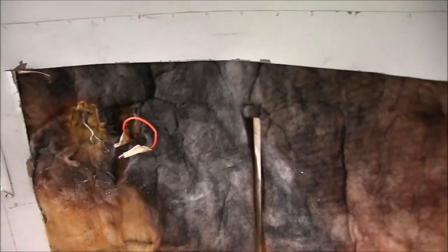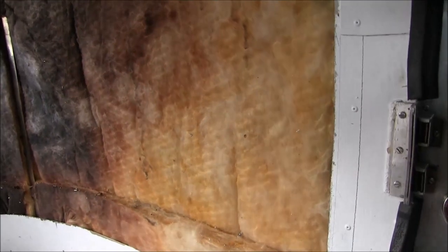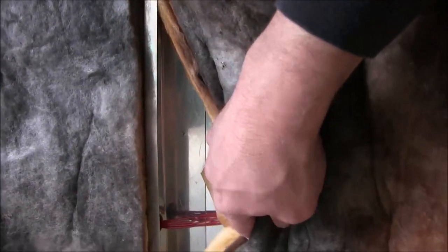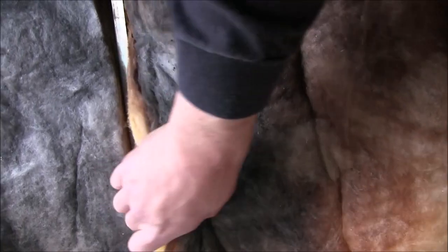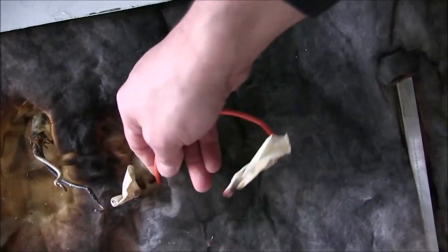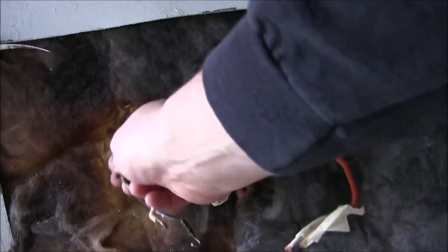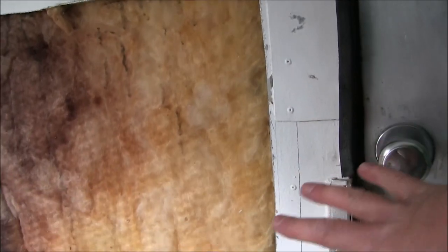You can see the discoloration in the aluminum and the insulation from the fire. You can see the regular insulation and what the heat did to it. And that's the outside skin right there. There are some of the wires running through for the outside lights. Now I know a lot of people at this point would try to replace the insulation, but I'm going to leave it — I think it's fine. It's not all balled up with rodent droppings. You can see the water pump wires right here — they come up from the bottom and this wire comes from the top. So now I've got to drill out all these rivets up top and down the side here so I can slip the new panel in place.